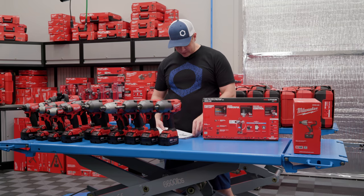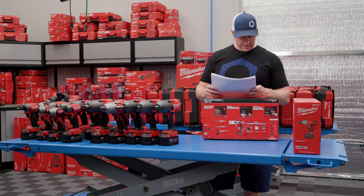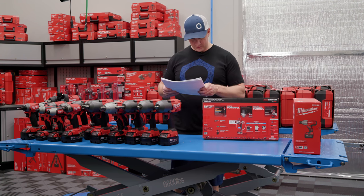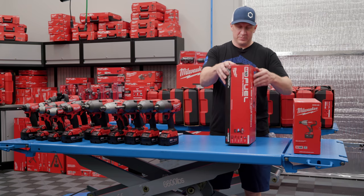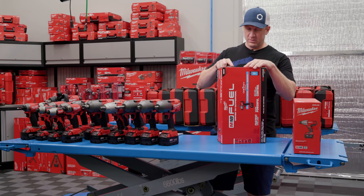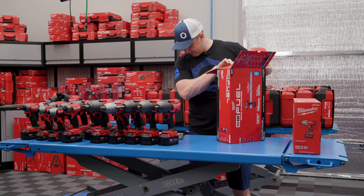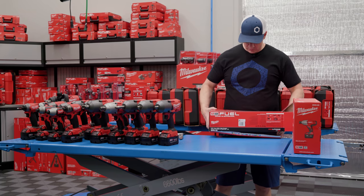So these are a hex utility. So I'm assuming it's the same as these quarter inch ones. It's a 7/16 hex. So I think you just need special tools, a special hex to go in here. Let's just take a look. The torque on this is 750 foot pounds, the same as the other half inch machines.